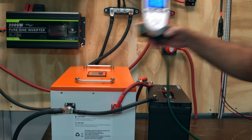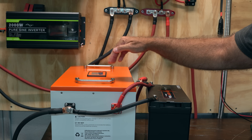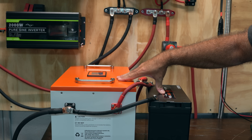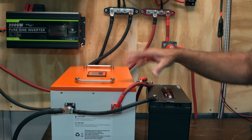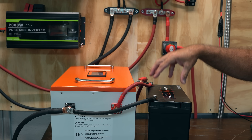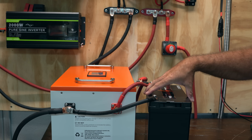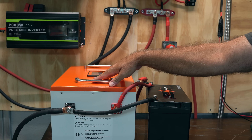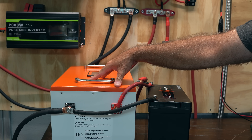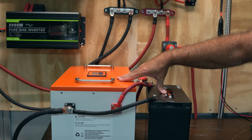So what does that tell us? It tells us that you are not losing capacity by connecting two very different capacity lithium iron phosphate batteries in parallel. But there is one caveat I would warn you about: this battery has a maximum sustained rated discharge rate of 100 amps because of its BMS limitation, while the other has a 250-amp BMS. So you do want to be careful about mixing and matching batteries with significantly different BMS outputs.